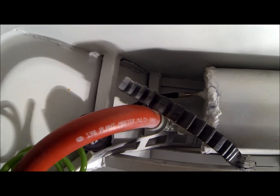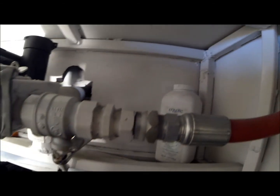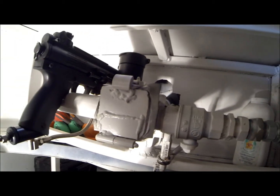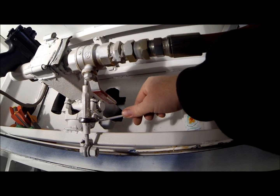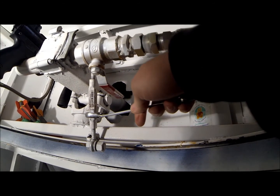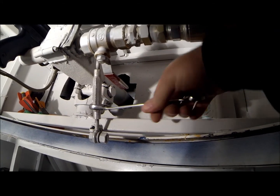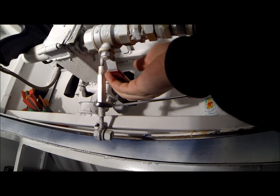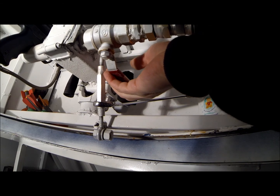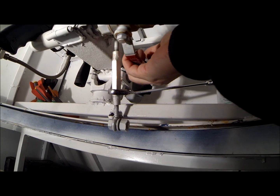Then off the tank with a three quarter inch multipurpose hose, it runs to our main gun. The elevation of the gun is controlled with a turnbuckle — it's got a ratcheting end wrench on it that can be switched direction so you can go up or down. Our trigger is this one inch ball valve, and to fire the gun you just aim the turret and dump the ball valve.